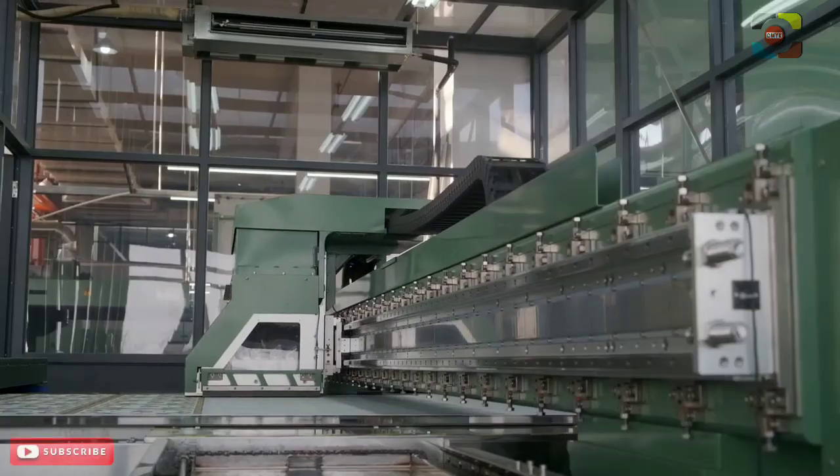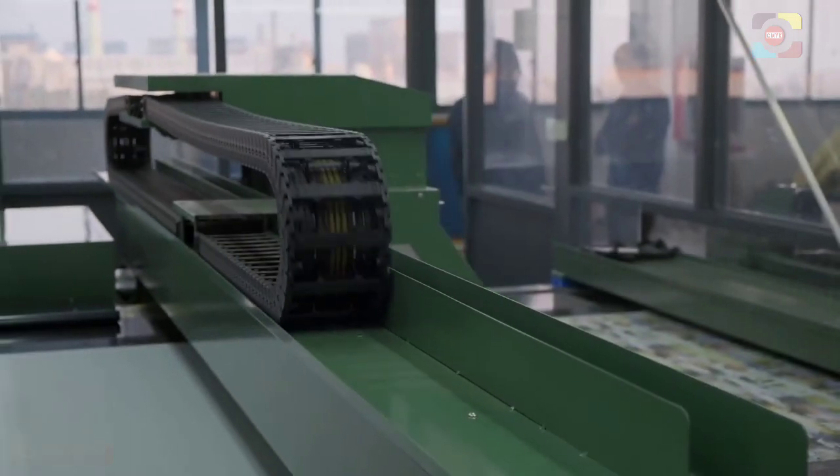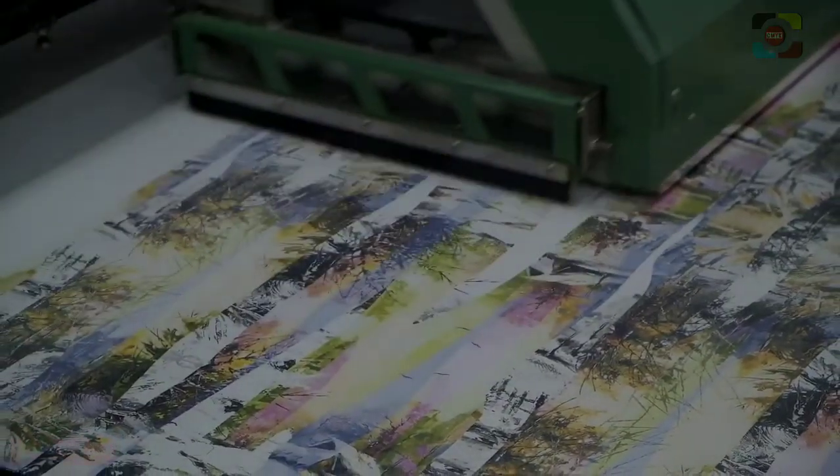It is possible to combine digital printing designs with gold powder, silver powder, or glitter, as these will be printed using the flat screen printing units. It is not necessary to prepare pre-treated fabric beforehand, as the pre-treatment process is handled inline on the flat printing system.